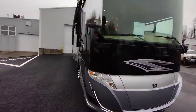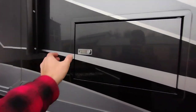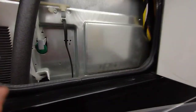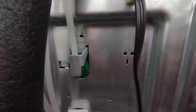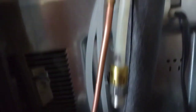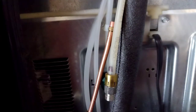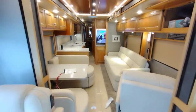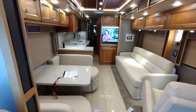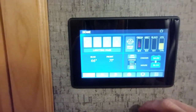Here's a quick walk around this Tiffin — it's a beautiful unit, currently for sale at sewellmotorcoach.com. This door gives you access to the back of the refrigerator. The line in my hand is the water supply line — you'll want to disconnect the union between the plastic line and the copper line, and at the bottom of the cabinet there's a turn valve to cut the water off. You can also turn the water pump on briefly to push antifreeze out through the valve before you close it.